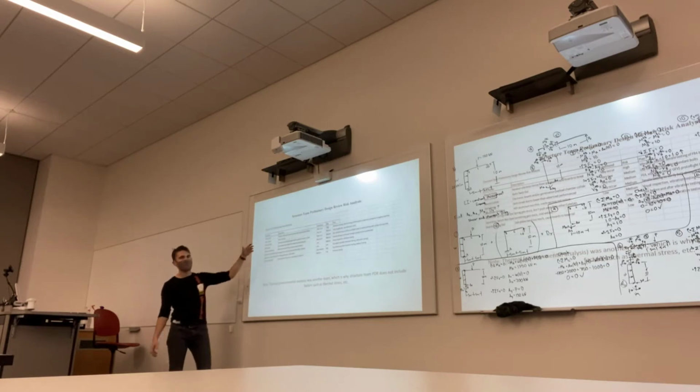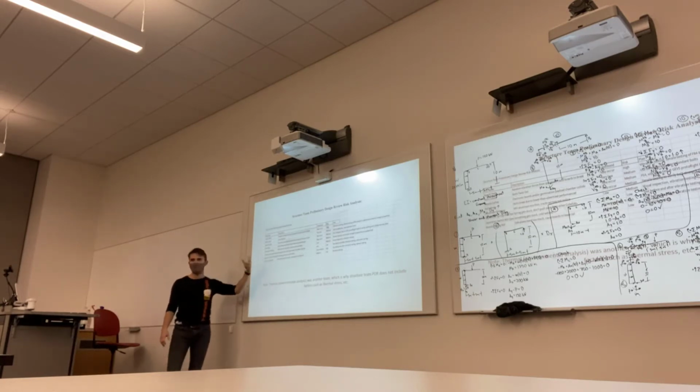Some of the things we looked at, again, because you have the structure itself, you have to worry about bolts. Are they going to basically yield or break? Are they going to twist out? Is the aluminum going to break? Because for certain random vibration environments, maybe there's a big moment arm as it's randomly vibrating. To worry about that. A couple of things about separation springs and switches. The thing we're launching out of, it's going to open up. You want the thing to eject out. That might be a concern for that. So you have to include that there for your risk analysis.